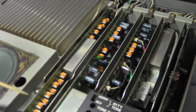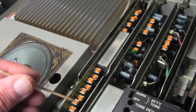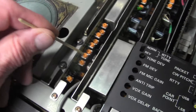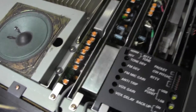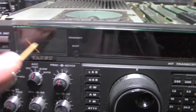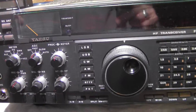Once the MOX button's in, adjust VR1003 — right here. VR1003, that's the third one up on the RF board. That will set it up, and you set it up to the ALC level, which I put just above S9 — just a hair above S9 — which seemed to be common on the 40 meters and the 80 meters.